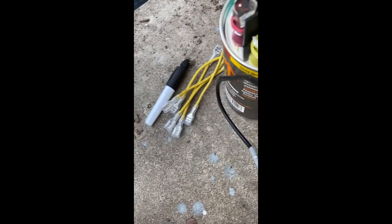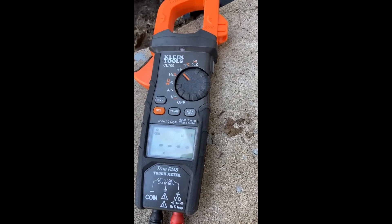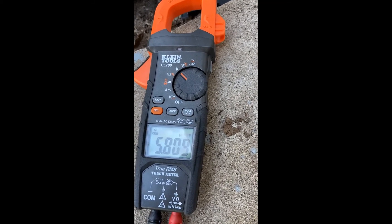That reading is within the tolerance. If I move to the five or six microfarad substitute tap, I get closer to six. So I would use the tap that gives me closer to five for the fan — that's going to be my fan connection, and I'll hook up the exact wire that was there for fan to that tap.